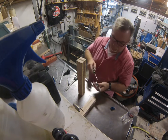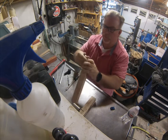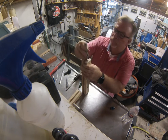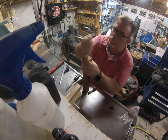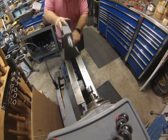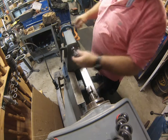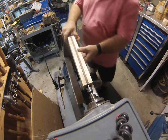It was hard finding a center for the live center — that round one. You can't really just put the point in the middle, and I know I shouldn't be beating on a bearing, but I wanted to make sure it seated in there very well. I beat the drive in there pretty good so it didn't pop out — made a good indentation.